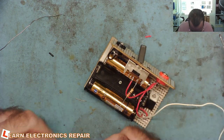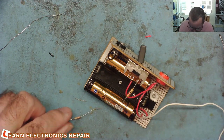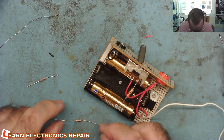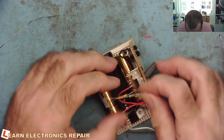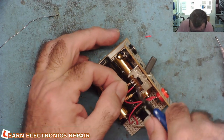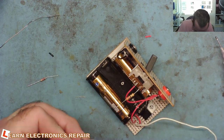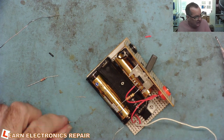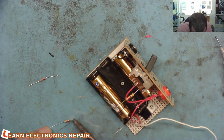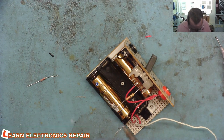The 120 ohm is brown-red-brown, and the 1.2k is next. We can cut these shorter and put them near the switch. Put a bit of flux on — let's put the wire on first and go across in order. There's the wire, now put the resistor on. Okay, they're all on — we can bring all three together, wrap them around, and tag on the white wire to complete our prototype.